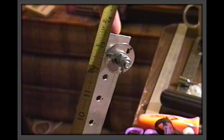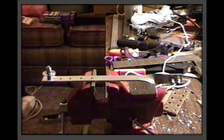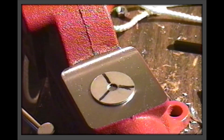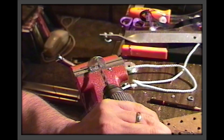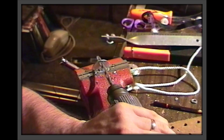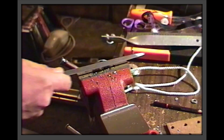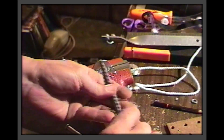Drill the first pivot mount one half inch back from the crank's end. Then add five or six more holes spaced one inch apart. Mark a flat washer into three divisions as shown. These lines do not have to be precisely accurate, just approximate in position. Drill close to the edge of the washer and well away from the center holes, so the holes will not be partially covered by the washers on the pivot bolt. Be sure to dress the holes with a file so the edges are not sharp enough to damage the nylon rope.